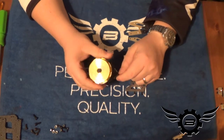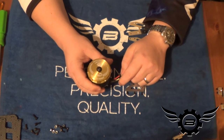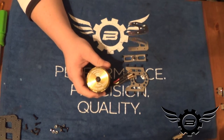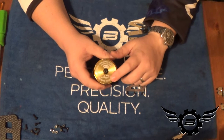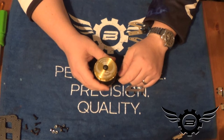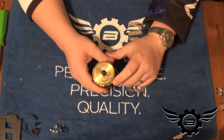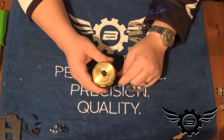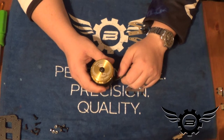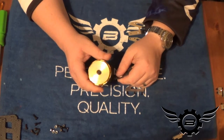I'm a Scorpion guy through and through — been a pleasure to be part of Team Scorpion for a couple years now. This is going to be a 12-cell 766, so I went with a 500kv motor. A 520 or 540kv would have worked just as well, but being that the kit comes with a 13-tooth pinion, I chose the 500kv to get my ideal RPM — I don't want to be in the 1700–1900 range, and the 13-tooth pinion with 12-cell is perfect with a 500kv.